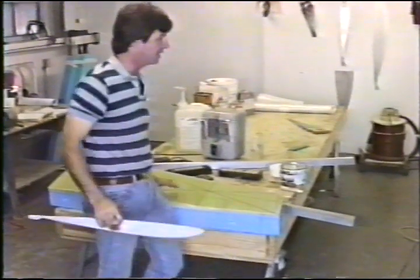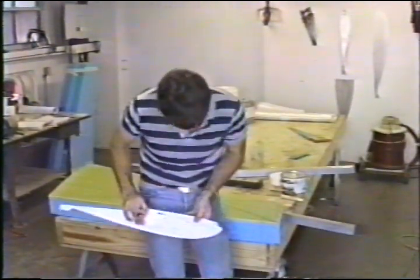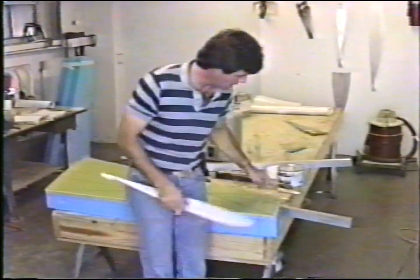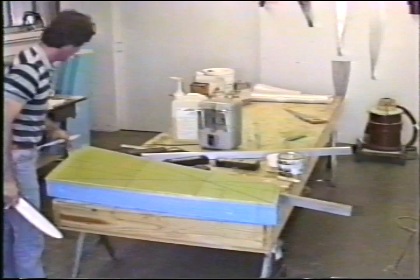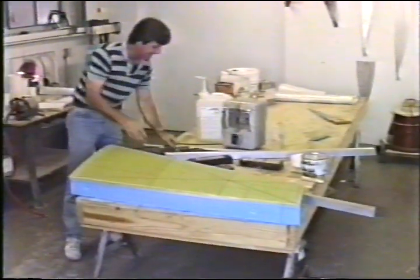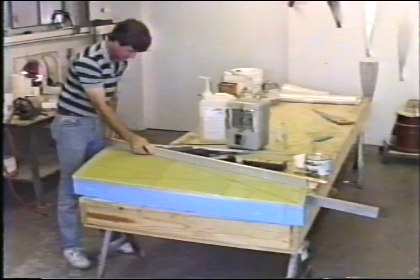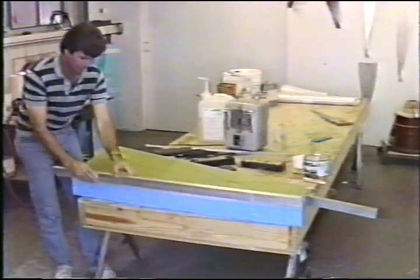All I have to do is find that template, and you'll see the number 3 on it. By percentage, they're the same distance back from the leading edge. So we've placed a mark after the leading edge to number 3, and the same thing here. Our extrusion will be bonded in place lightly at the upper and lower end with a couple of blobs of Bondo. This one in this area, and then another one like so.